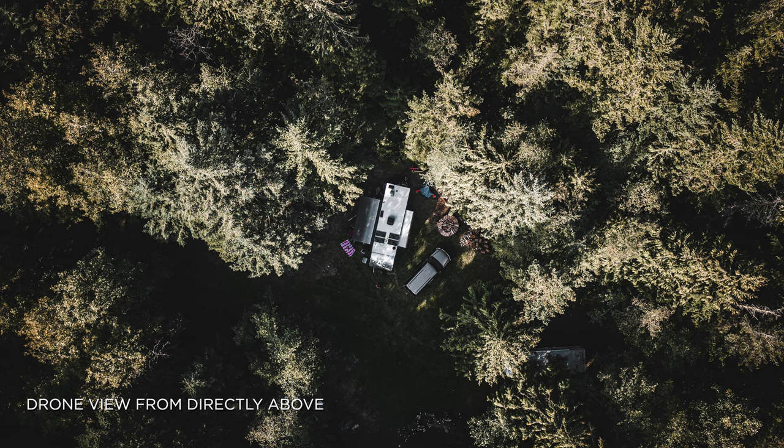We're also in an area where we're not getting direct sun exposure until about 11 o'clock in the morning and losing most of it by about three or four in the afternoon. By watching a lot of videos and educating myself prior to doing this install, I learned that I want to have more wattage than I really need — because in instances with lots of cloud coverage or rain, my 400 watts of solar panels might only produce around 40 or 50 watts.